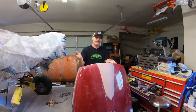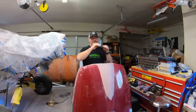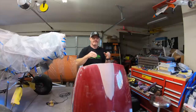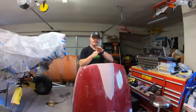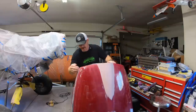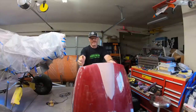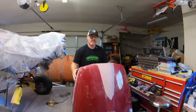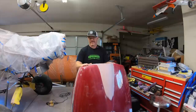Like when you get the cowling from the factory, you have three different pieces and you set them all together, and the finished edges are really rough. Some of them are actually purposely longer than they need to be, so you can adjust it on your airframe. Then you have to work those lines to get that seam right on all three pieces. That's extra time that I could take, that time of fitting those three pieces together, and work the outer portion the way I'm doing it to finish off the bodywork, because it's not going to be that clear gloss finish on the outside.